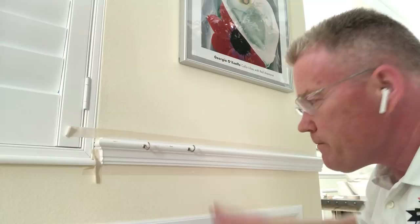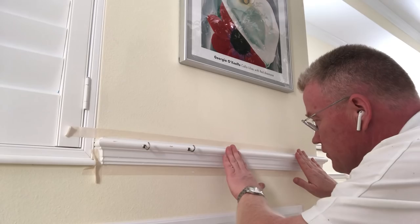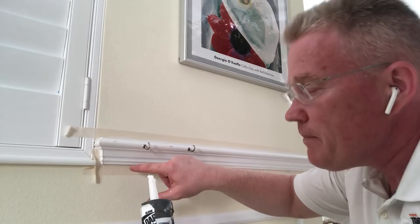As you're moving it, you go about an eight-inch section, nail it down, rub it this way. You move it up and down until it's perfectly underneath the chair rail, then rub it down with your left thumb, sealing it. Then you take clear caulking — please make sure that it's clear — and seal the area where the tape meets the woodwork.